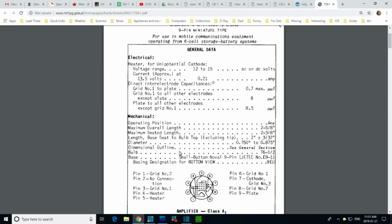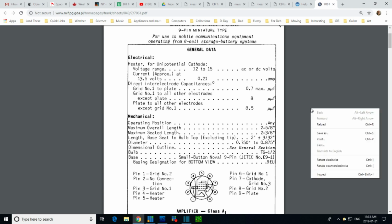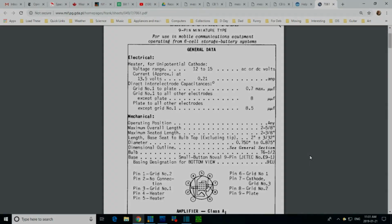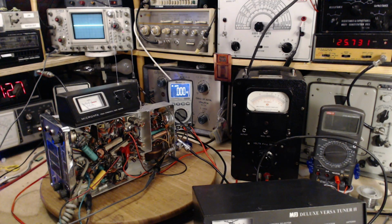The story is, I'll get it in my head nice and clear, 40 milliamps in the plate current, and we've got problems. 22 is actually below the minimum that the tube is rated for, according to this sheet, so we could let that plate current go up quite a bit. Unless, of course, it's 22 with no modulation, and the designers know when you go to talk into it, you beat the radio up that much harder. 22 in effect becomes 30-40. I don't know, but I'm feeling pretty good about continuing here. Feeling pretty good about continuing, but boy, it's getting pretty late.